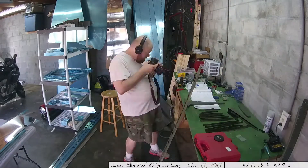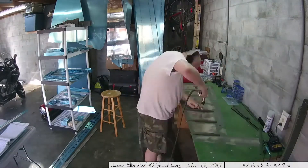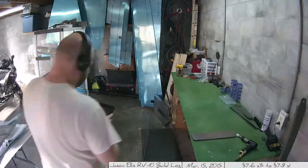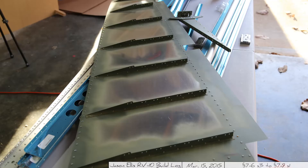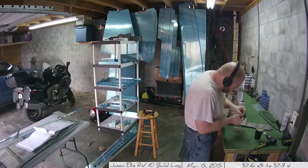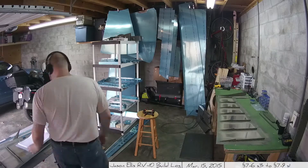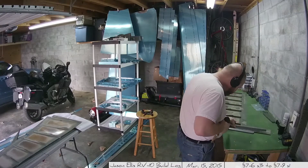This is obviously the next day and I'm on to section 7-7. What I'm doing here is putting lots of rivets in the little holes and then using the back rivet head to back rivet those stiffeners onto the skin, which is kind of interesting. I like how they did this — they make you build the skeleton, then intentionally split the parts into either half, and when you put it all back together you zip it straight up the middle. Clever.